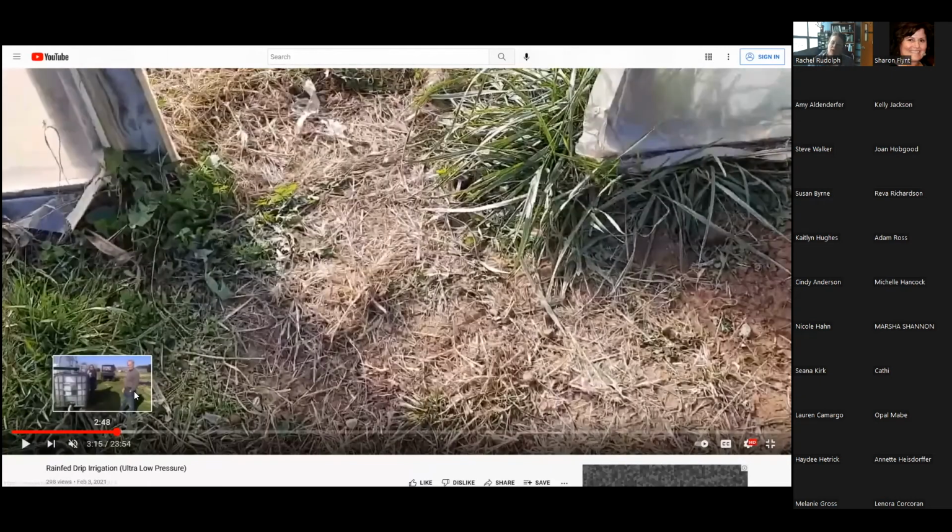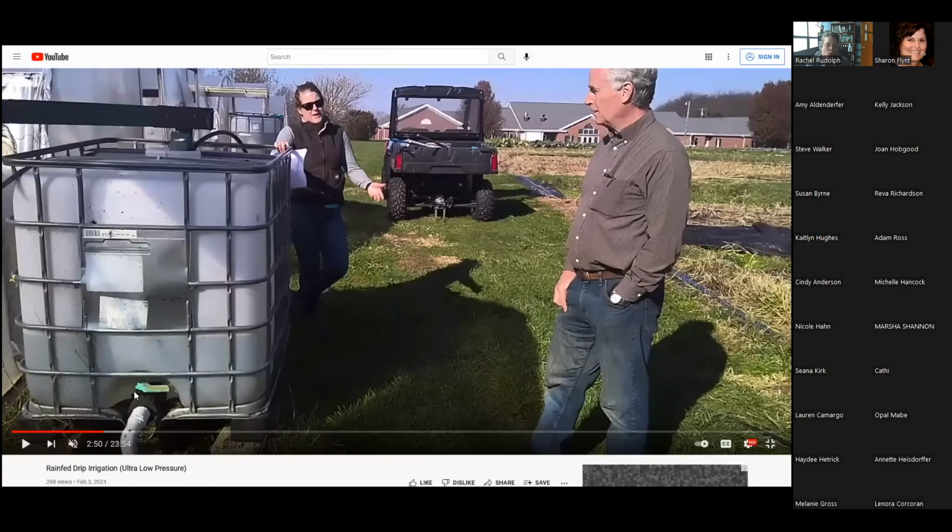you know, when you think of a water hose, that's pretty small, that's 3/4 of an inch. And you say, oh, well, that has great pressure, right? Well, that is pressure coming from municipal water in the system, right? And so actually we want this opening and the following main line to be as big as possible. So 2 inches, 1.5 inches, you want it to be very wide for less friction.